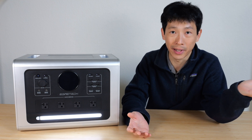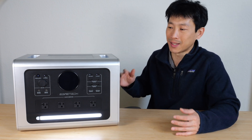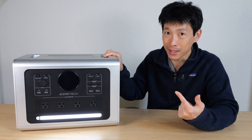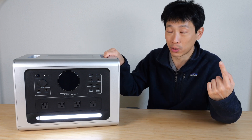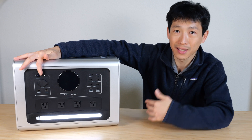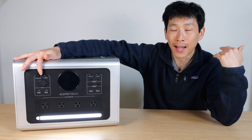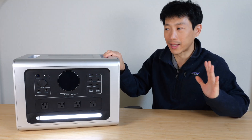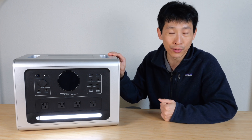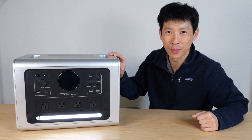Overall it survived all my tests — nothing is broken. When I first looked at this device it seemed boxy, but after testing it I feel like they didn't lie on the capacity. It handles 2200 watts just fine. If you go over current, some devices shut down and pop a fuse you can't easily replace — but this one recovers on its own. Overall I feel like this is a pretty reliable device. If you're interested in getting one, check out my Amazon affiliate link in the video description below. Thanks for watching.